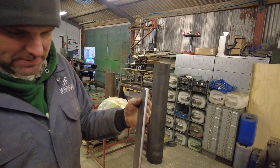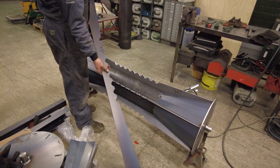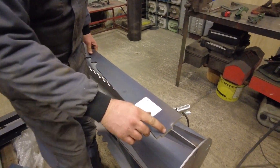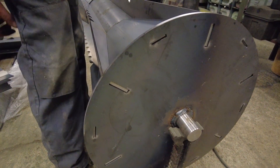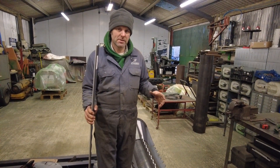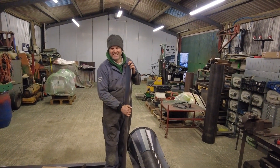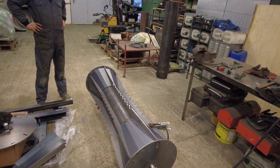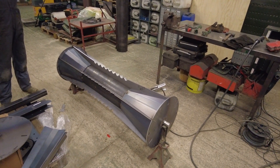So that is one of those, and that obviously goes in there. That there is the tab that fits into one of these holes here - that there is the end of that. Because of the way it's all cut, it means that the tube in the centre centralises. It works out quite well. Thanks to all the effort at the computer, but it's just a big Lego set - there's tiny little pieces, and you might get a bit of swarf in the way. But because it is that well toleranced, you can just push the things together and it's all square.